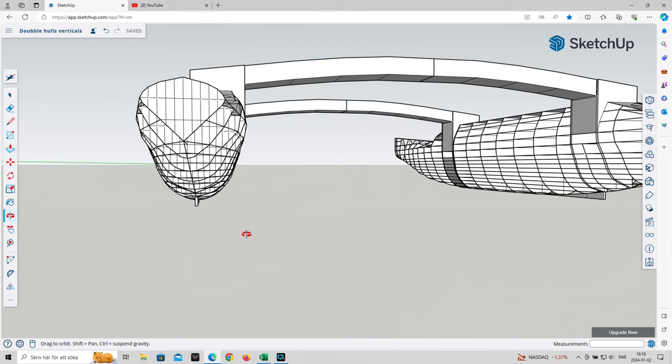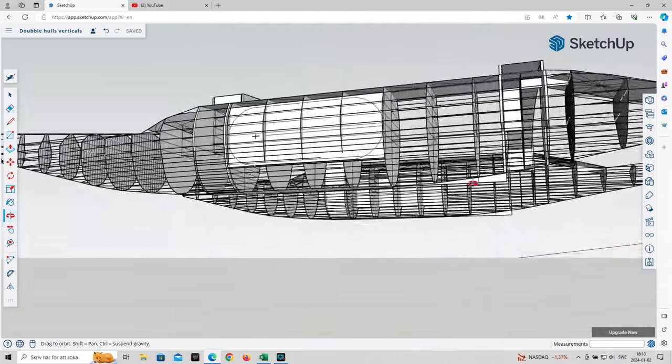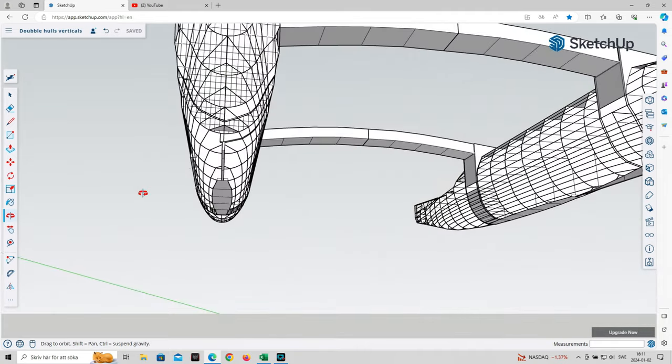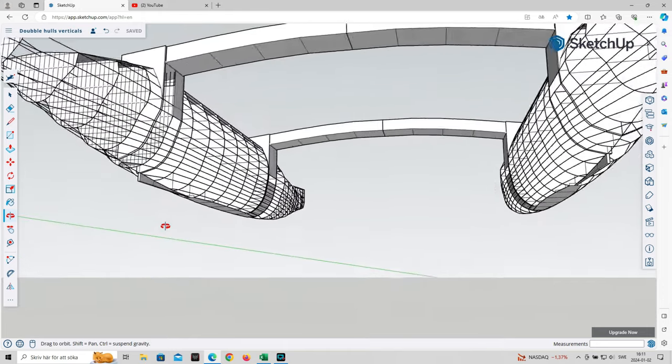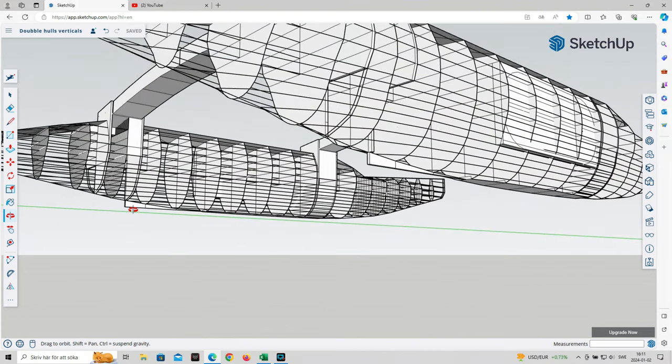The bottom I made flat so it could be self-standing when mounting the pieces together, with a short keel to also extend the self-standing part down back to the back pillar. So this pillar resting the crossbeam will have support from the ground on the flat surface. It won't add that much water resistance, but I made it as short as possible. One could extend the keel a little longer to have less need for a centerboard, at least in low speeds.